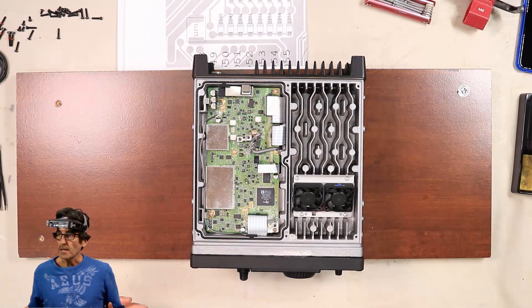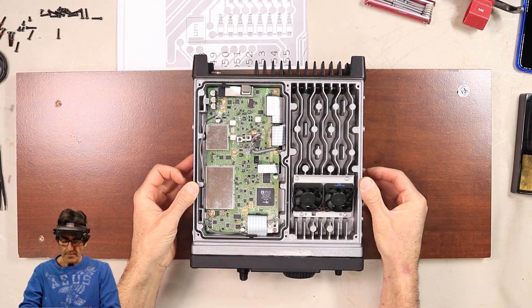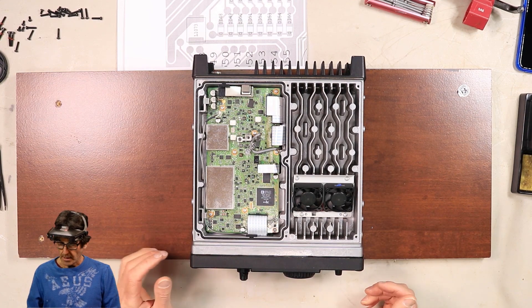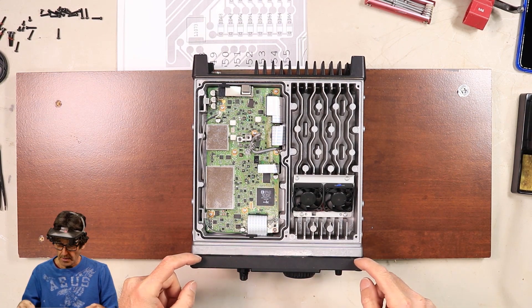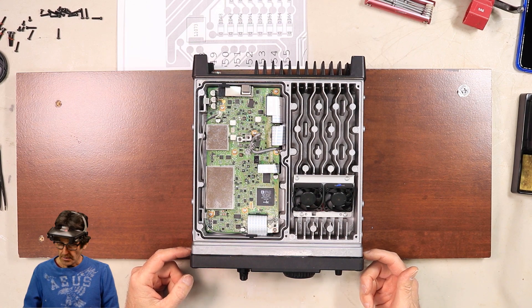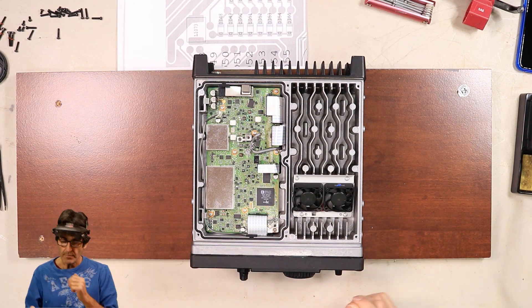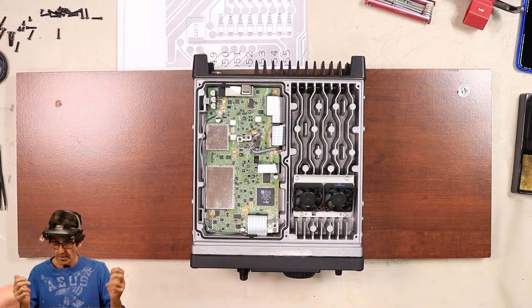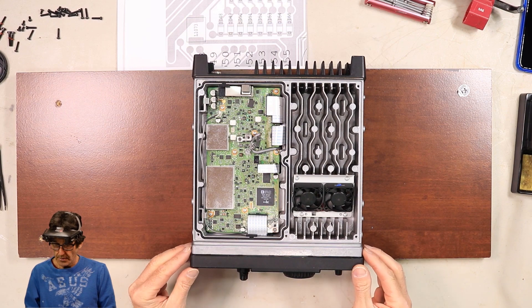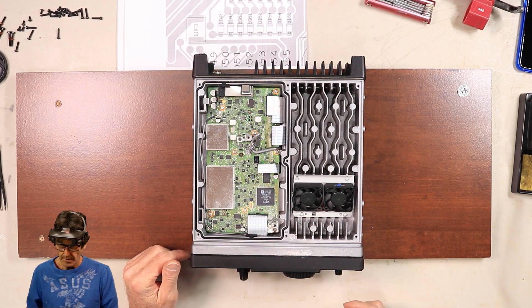As you can see here, I went ahead and removed the top and bottom covers. You might be able to get away with not removing them, but I chose to because this lip right here where the cover meets the front panel is probably pretty tight, and you'd have a hard time pushing that back in if you leave the covers on. You don't need to remove those covers other than the fact that this lip right here needs to slip underneath of them when you put it back.